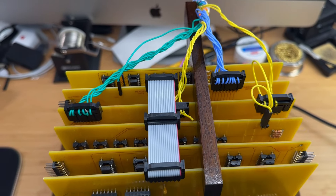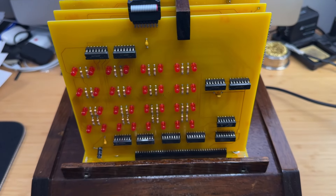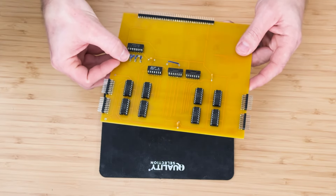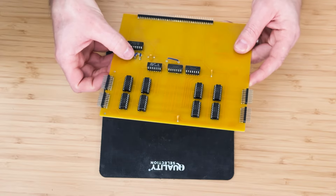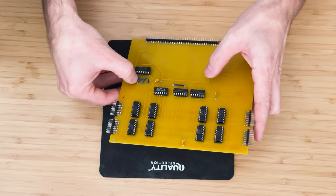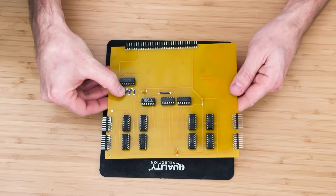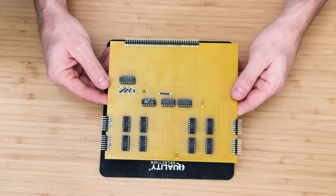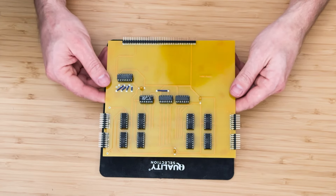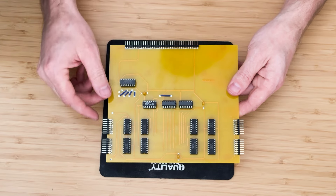As this testing process is important — before we start, there is one thing we missed during the assembly of the boards: the jumper wires on the output board. Notice that we can designate up to seven output ports with the jumper wires. Since this is the first output board, we can set the port positions A through D to positions one through four, defining output ports one through four. Also don't forget the required jumper to the left of the capacitor.